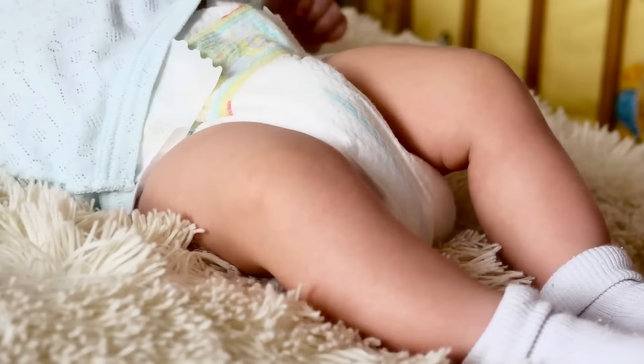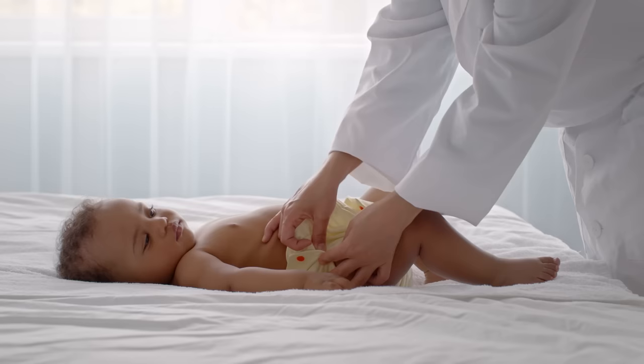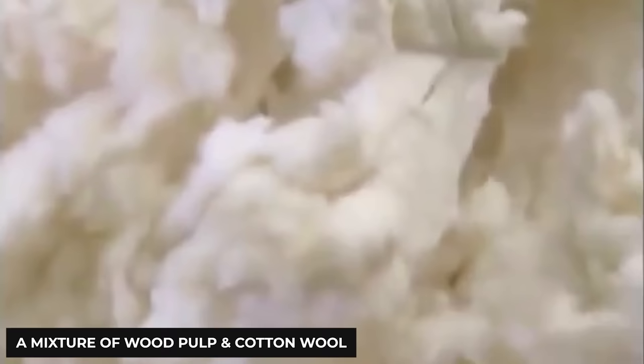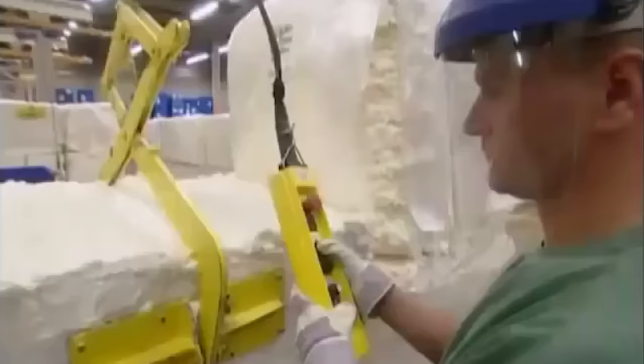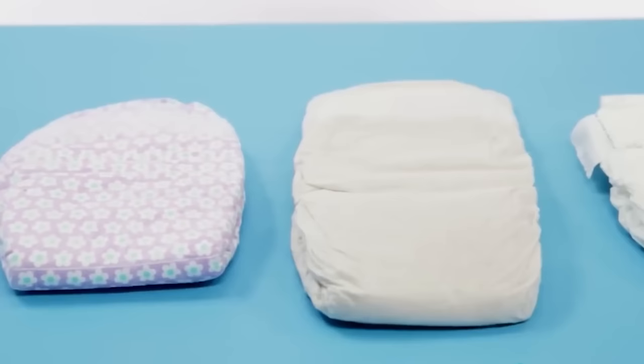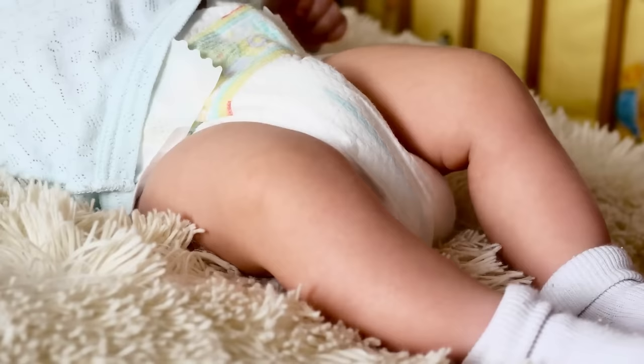Now, while most of us are familiar with the fabric-like outer surface of diapers, the main material used in their construction is actually a mixture of wood pulp and cotton wool. This pulp is used by processing pine wood, much like how paper pulp is made, and it is mixed with a specified quantity of cotton to create a soft, lightweight, and most importantly, very dry material that'll make up the cushion-like interior of the diaper. And to do that, these materials, once combined, are brought onto the first manufacturing step: the mixing of the core.